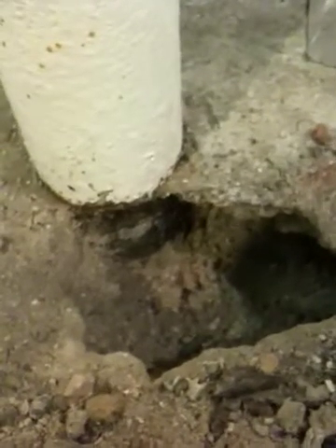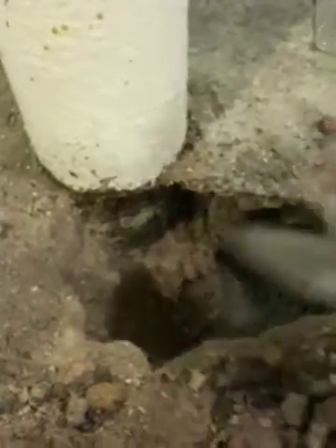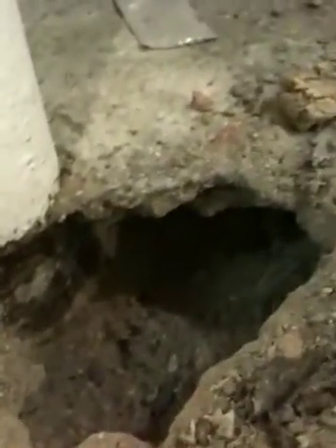Here's the base of the lally column that I was concerned about. I broke through this very thin superficial layer of concrete — it's only a couple of inches thick — and underneath there was just loose pack, which was easily excavated out with a trowel. So there's actually essentially a cavity under here once you dig out. This is basically a floating, non-structural layer of concrete.